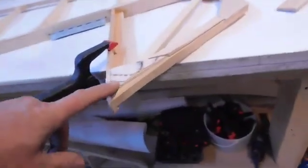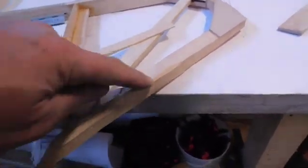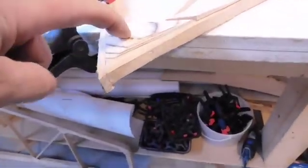One thing I have to ask the guys with the actual kit plane - I was running into the same issue here. This is one and a quarter, this is three quarters. When they meet up there, you have to put in those quarter-inch fillers on both sides. But then it's got a taper all the way down, and I wasn't sure about the taper. So I'm adding a wedge in there so that the taper is nice all the way from three quarters up to one and a quarter. On the other side, I'm going to do the same thing - add another block in there to raise it from three quarters up to one and a quarter on both sides.